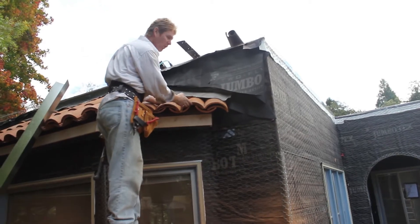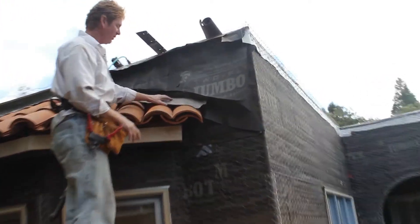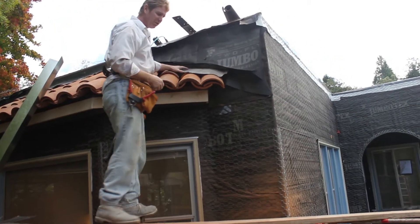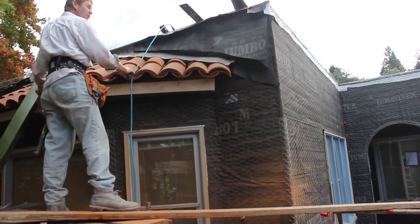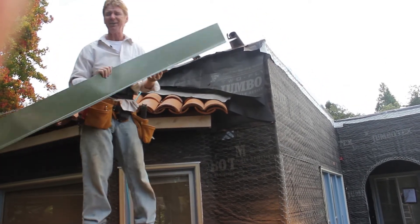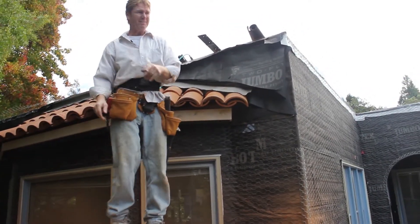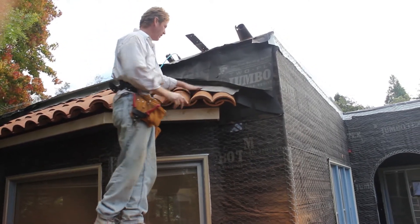These folks did the tile well. They put a membrane down, put the tile on it, and they put a lead flashing, and they also did concrete underneath the tile. The lead flashing comes over the tile about six inches. I'm pointing this out because several years ago on another job I declined, they had this flashing and I said that's not the right flashing to use. I ended up not doing that job because of that. But anyway, this is the proper way to do it.